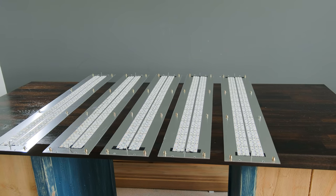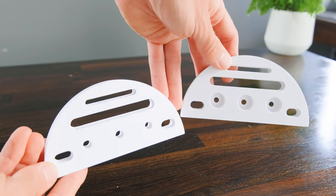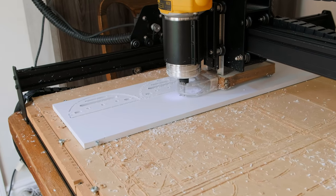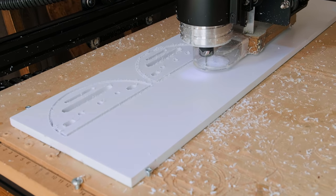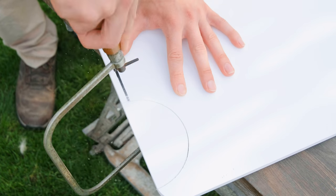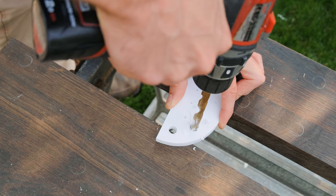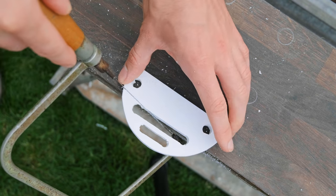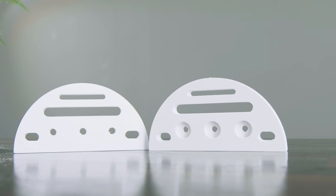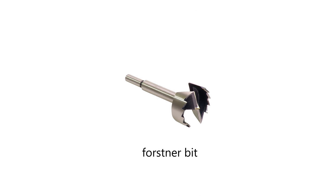Once they've been added to all of the aluminium backs, we're almost ready to wire them up. Before we do this however, we need to make some semi-circular supports, which can be made out of a sheet of low-density PVC plastic — the stuff used for sign making. I have access to a CNC router so I just left it to cut them out, but to make these with basic tools you can mark out a semi-circle with a 7cm radius and carefully cut it out with a coping saw. We need to make some vents in it too to allow air to circulate, so we can drill six holes and join the topmost two together with the coping saw. Each light needs two of these semi-circles, and the three component holes on the second one need to be heavily countersunk for the brightness knobs to later fit into.